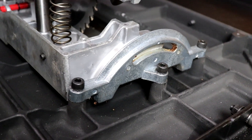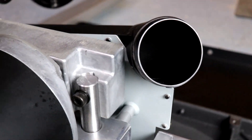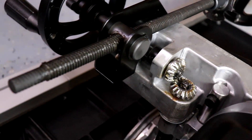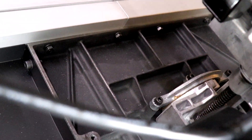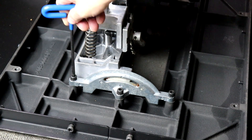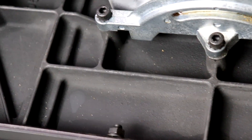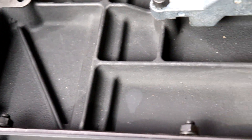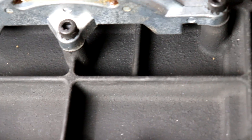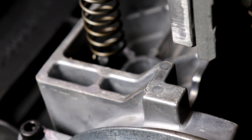With that, I'd suggest running the saw on a dedicated 20-amp circuit. The trunnion assembly on this saw is substantial compared to other saws in its class. Trunnions are critical because they support the working components of the saw and maintain the blade's orientation to the table, which is critical to maintaining a cut's angle accuracy. If you ever have to realign the blade and miter slot, you would loosen three bolts on each trunnion mount and make the adjustment. As a hybrid saw, the F1 uses its cast iron table to support the motor assembly, and Laguna has incorporated heavy webbing into the castings for both the table and the trunnion assembly to prevent table sagging.